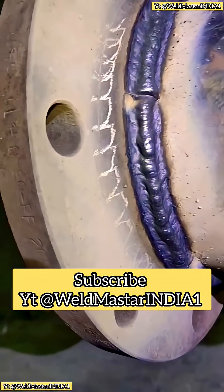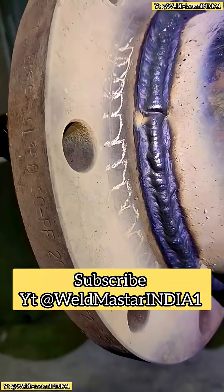The current for the flange shouldn't be too low. For the root pass we used 90 amps, and for the cover pass 100 amps is fine. The electrode is also 3.2 millimeters. Pay attention — watch the weld bead carefully. The bright, shiny part is the molten pool; behind it is the slag. Now we're on the upper side — this is the vertical position, starting to weld upward.